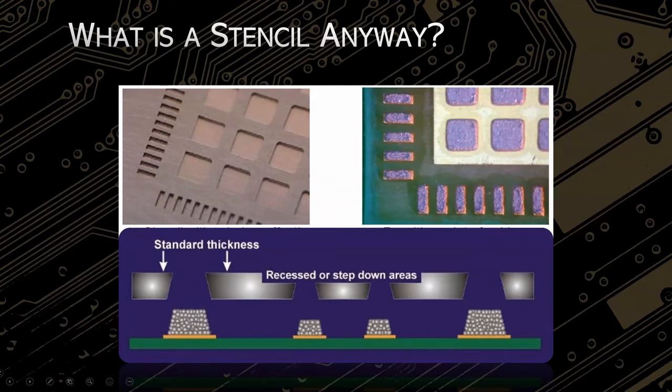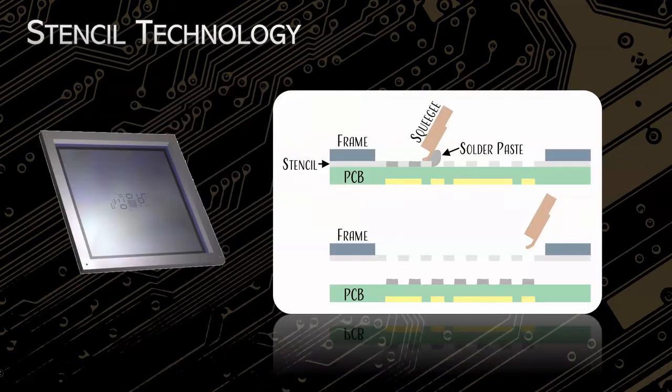What are stencils? Stencils are kind of the old-school technology. It's basically just a big sheet of steel with holes cut out of it. You take that stencil, line it up with your PCB, take a squeegee and your paste and squeegee the paste onto the board. When you lift that stencil up, all of the paste inside those holes — if you're lucky and chose the right type of solder with the right size apertures — will release that solder paste onto your board. At that point you can go to your pick-and-place machines and start placing parts, getting ready for reflow.